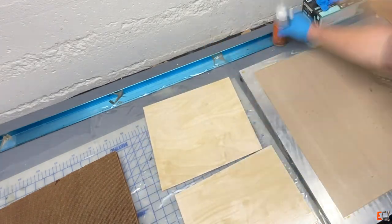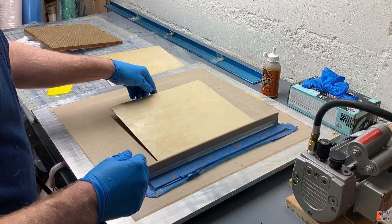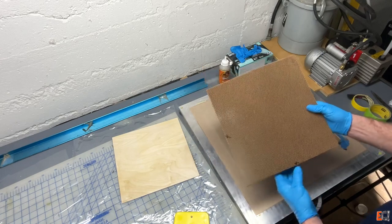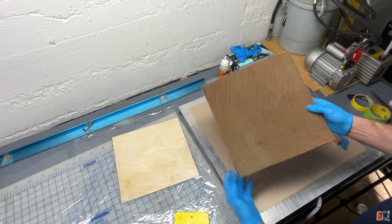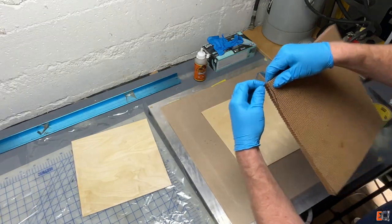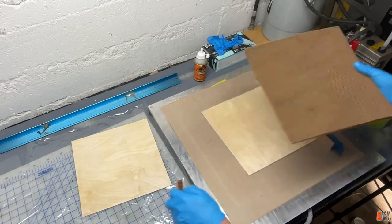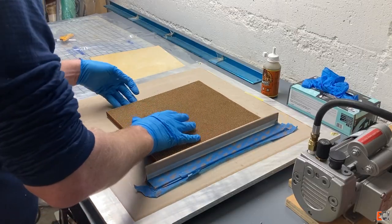I'm laying these out and making sure to align the outer veneers of the plywood — which I'll call the zero direction — with the ribbon of the honeycomb. When the honeycomb is made of stacked layers of paper, there's one direction that's got the long axis of the cells, and that's the direction the paper strips run. You can see I'm peeling it off here, and that is the stiffer, stronger, better shear properties direction of that core.